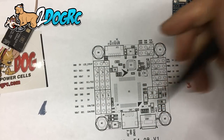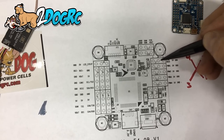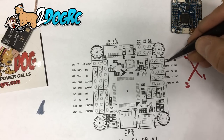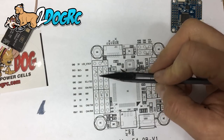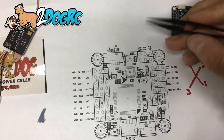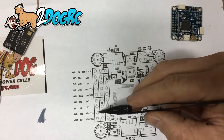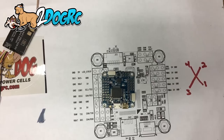So that's basically it — we've connected our camera, video transmitter, and our receiver. This won't use PWM; it's only S-Bus or PPM, and I highly recommend S-Bus. Your four motors go here, battery power comes in at ground and V-Bat, and the buzzer goes here. For the RAM pin, you have to do something with it to get power out — but if you're going to power your video transmitter and camera off your power distribution board, you don't need to connect it at all. If you like one of these, pick one up at 2DogRC — they're 30 bucks. It's pretty easy to wire in. Enjoy.